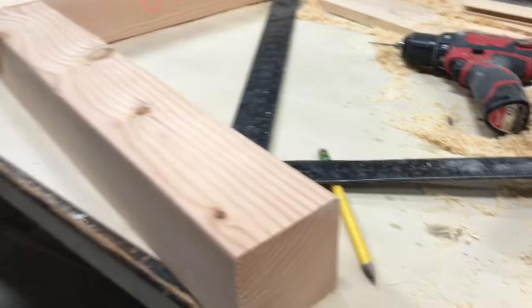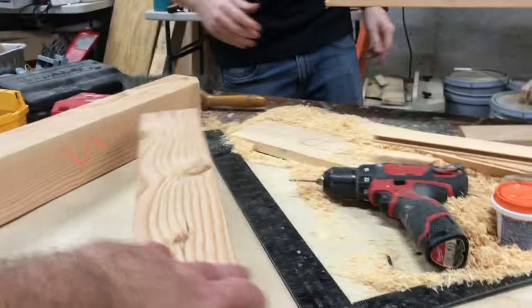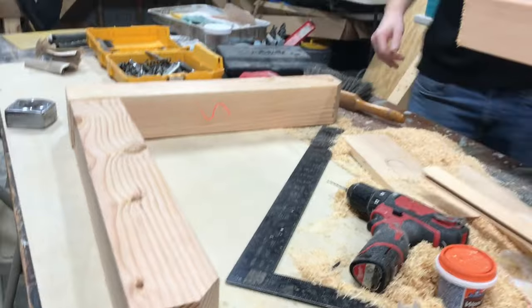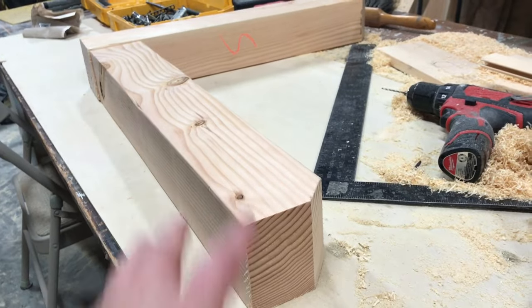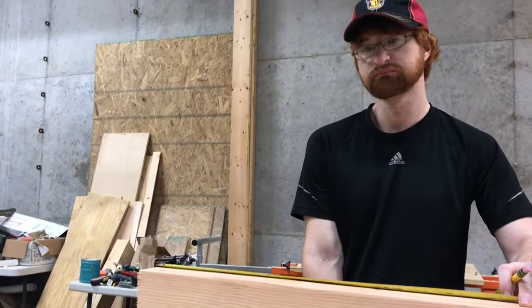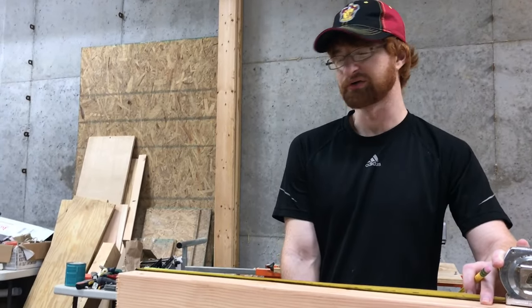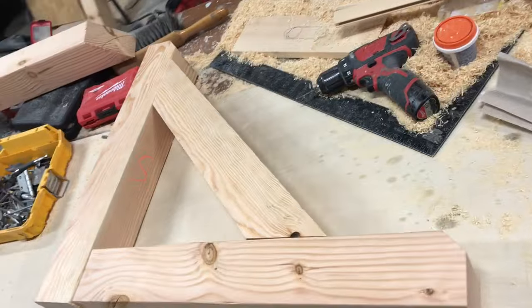It also gives you a place to put a big bolt in down here - I'll show you that when we sand it later. You can see where this is going already. We're keeping everything in two-foot increments so our material works out, because we have eight-foot four-by-fours. You can buy Douglas fir four-by-fours at Home Depot, untreated. I don't like treated lumber for this because of warp, twist, crack - everything. These are going to be up under the soffit so you don't have to worry about them rotting. The only thing I'm worried about is woodpeckers and carpenter bees, but that's just regular maintenance.